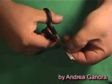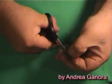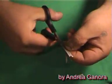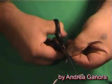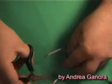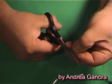Each half of the blade can be cut into two more pieces. In this way, from each blade we will have four slices, and this will allow us to make two switches. At almost half a centimeter from one end of the little blade, we will cut a small notch. This will make it easier for us to tie the wire on the little blade and avoid the wire from slipping out.